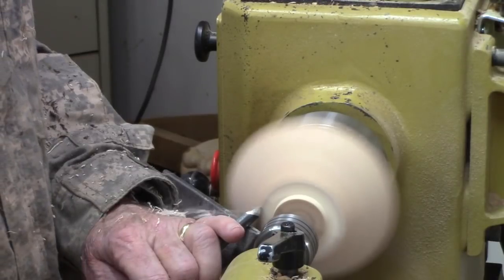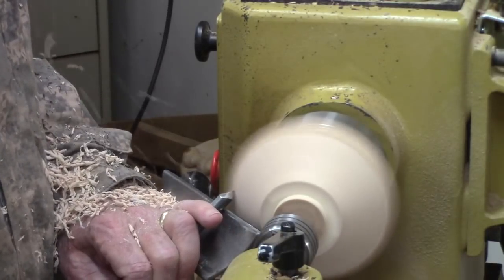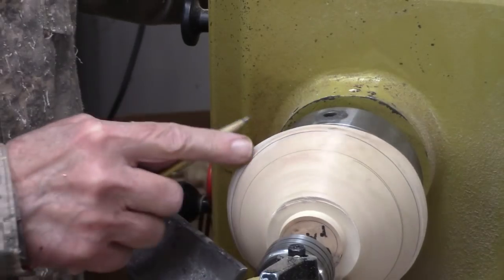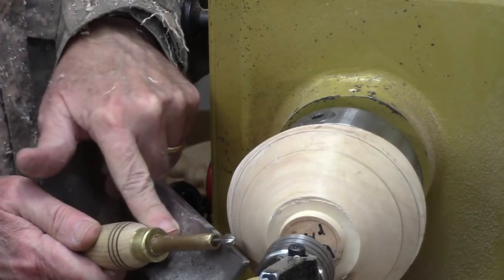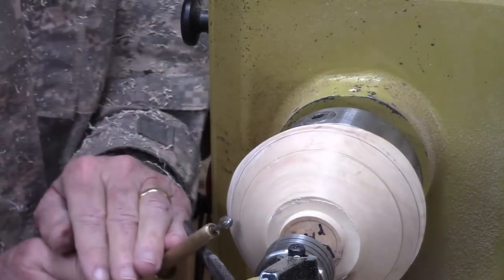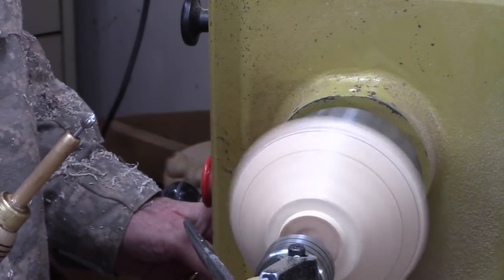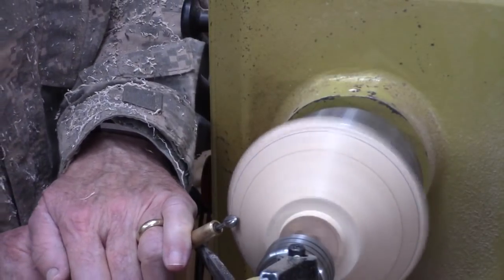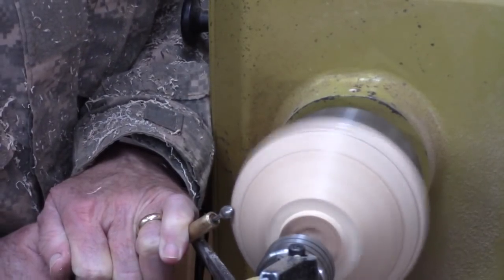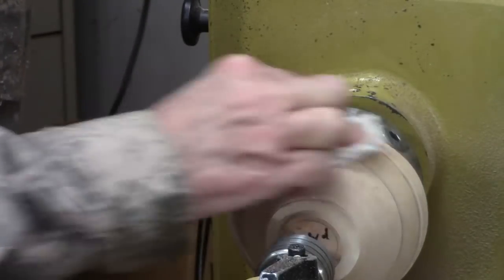It probably won't fit normal jaws — I'll have to use a smaller chuck. Now we're taking on the side and you can see from the ghost image that it really is out of round as we clean up the outside. Then we'll do a little texturing on the outside. I've marked a couple of rings up in the upper third away from the edge, because the edge has really gone oval. So we're going to use the burr — adjusting the tool height — and now we just come across with that burr. Having to adjust the speed a little bit. Now I put some real pressure on it, I'm pulling it with my left hand. I'm rubbing on a little Mylands sanding sealer hoping it'll make it pop, make it easier for you all to see on the screen.